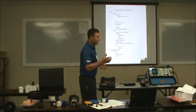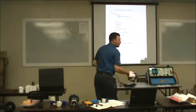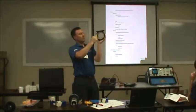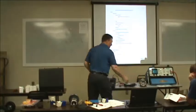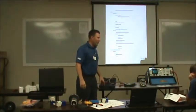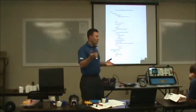We actually want to block it. What you want is you don't want this insulation to fail in this motor between the windings and the case, whether it's in your slots or elsewhere. If you've got a megger, I tell everybody, if it reads above one, you can probably run it. But be looking at that 1 megaohm, so that's 1 million ohms.